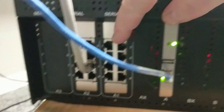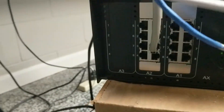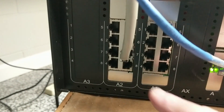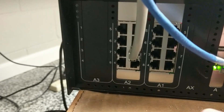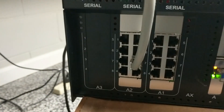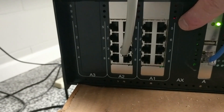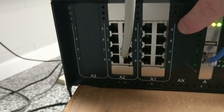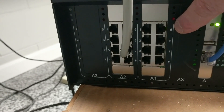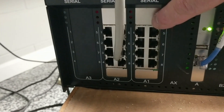On the back, these are called NICs, or network interface cards. You can see A1 and A2, which correspond with those front lights. In most cases at stores we'll have A11 and A15 plugged into the FCI box — that's fuel control. Even if you have both cords, we're only using A11 for the fuel side; the DCR side is done differently now.